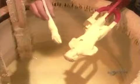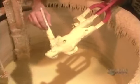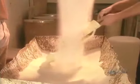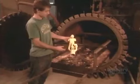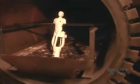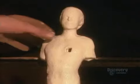They dip the wax replica into a ceramic material. Then coat it with powdered silica, a common mineral, to strengthen the ceramic. Next stop, an autoclave. In about 10 minutes under the machine's hot steam pressure, the wax inside the ceramic shell melts away, leaving a hardened and hollow ceramic mold.